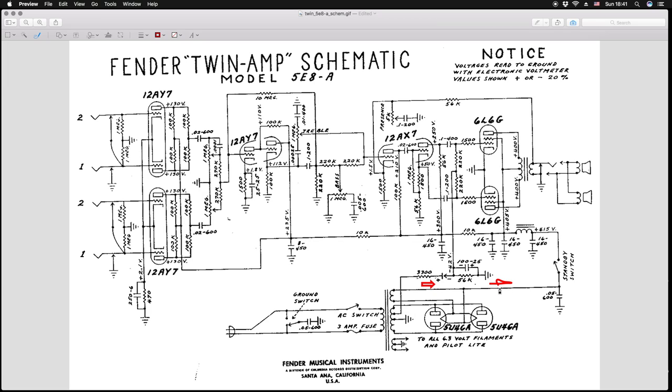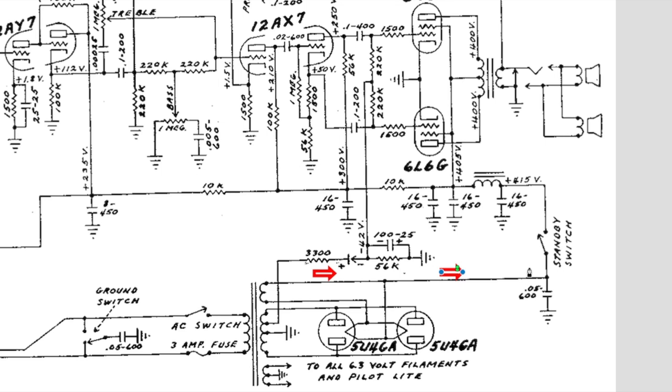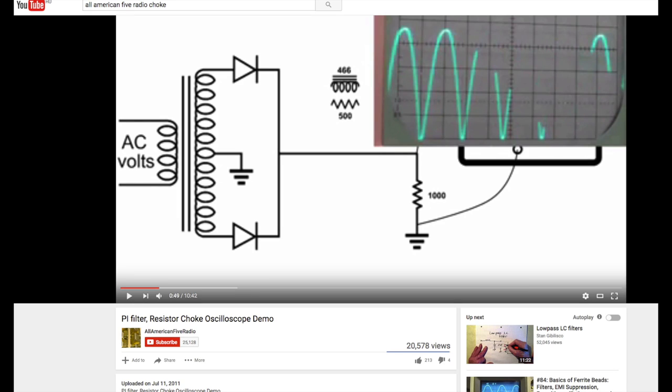Also, a choke is a lot more effective at smoothing down the ripple from the power supply, so it makes the amp more quiet, and it also takes part of the stress from the output transformer, making it more efficient in delivering a final tone to the speakers. If you would like to check the effects of choke versus a resistor visually on the oscilloscope, please check the video of a fellow YouTuber, AllAmericanFiveRadio, in the description.